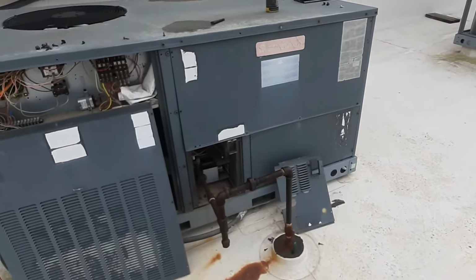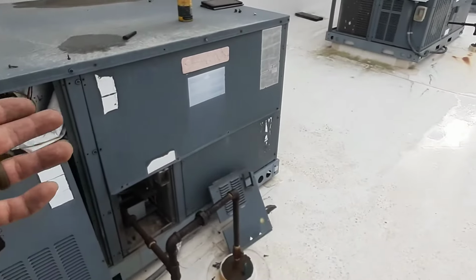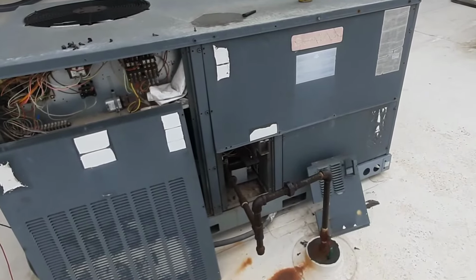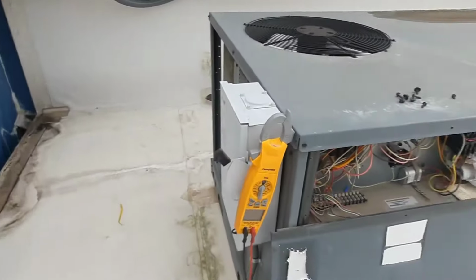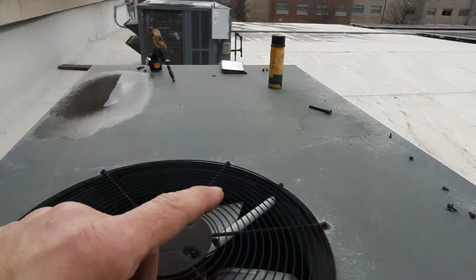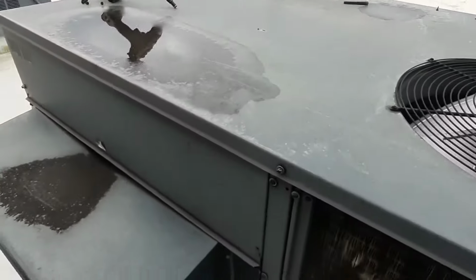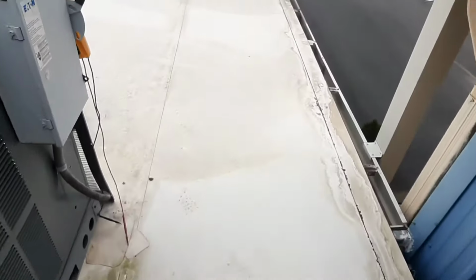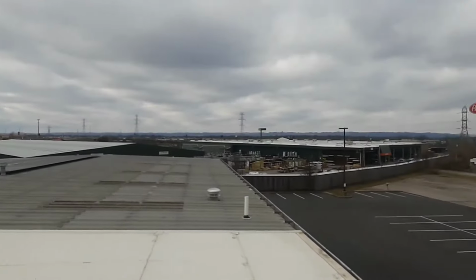Airflow. 90% of what we do is airflow, guys. You're gonna walk up on basically everything you come up on and have an airflow issue, at least where I'm at. Especially with age, you got a dirty blower wheel, you've got insulation falling, which we did fix. We've got some insulation spray glue. Filters are clean, so we're gonna let this guy go. We'll go talk to the customer and move on to the next one. Leave a tray better than you found it, guys. See y'all next time.